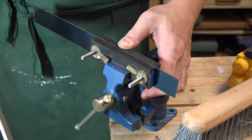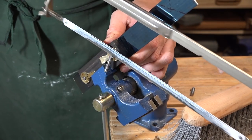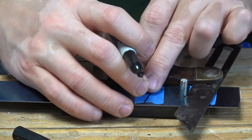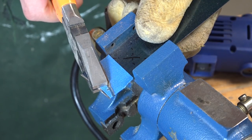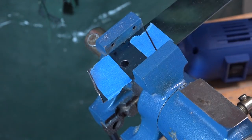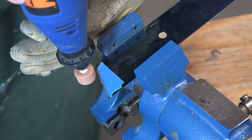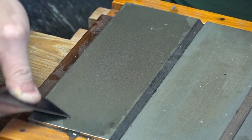As I was trimming the bolts down, I was reaffirmed as to why I always wear safety glasses. I set the bevel gauge to about 20 degrees, and I found that the cutting wheel is the most effective tool I could use to cut this carbon steel. With each successive cut the quality of the cut also got better, but clearly not good enough, so I used a grinding stone to clean up the edge, and then the final cleaning is done on my diamond stone.